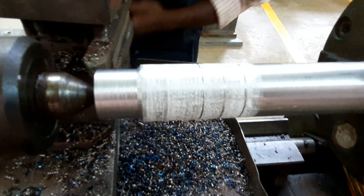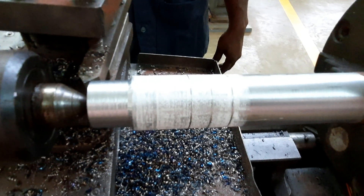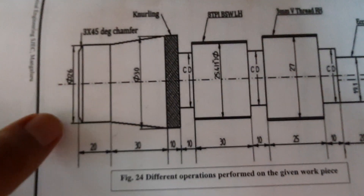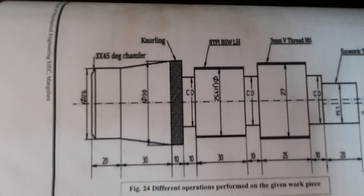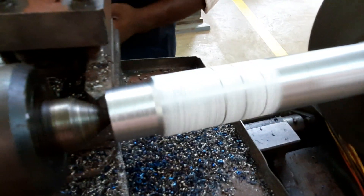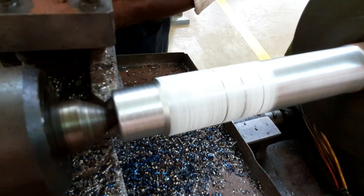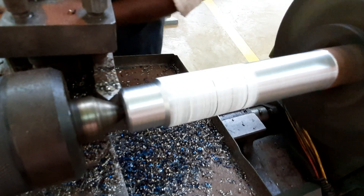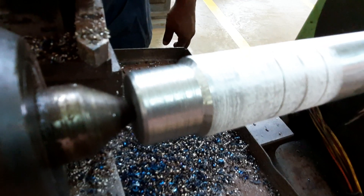The diameter is now reduced to 26 mm. There is a chamfering at the end of the workpiece — a 3×45° chamfer is done to avoid damage from a very sharp edge that could injure your finger. The other end of the tool is used and cutting is done using the side face of the tool. Chamfering is now complete.